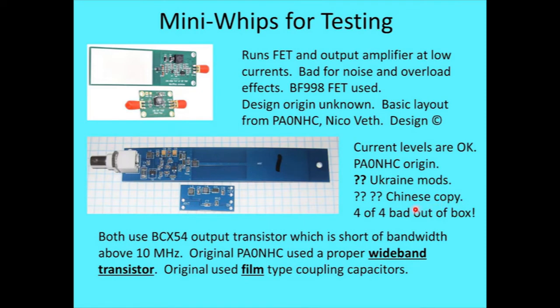The other two were exceptionally interesting. That BF998 FET was available in two pinouts, apparently pressed by the TV tuner industry. Well, the other two had the FET of the wrong pinout. I finally figured that out from the totally bizarre voltmeter readings. So I got two of them sort of working again. And that cost me a lot of time on getting things going, to say the least, getting junk out of the box. So I'm not sure if it's five out of five or four out of four bad,